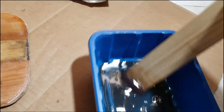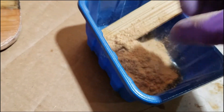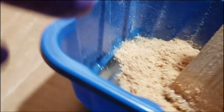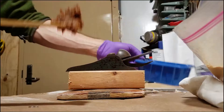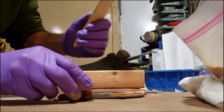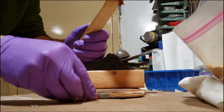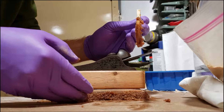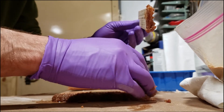I've mixed up another bit of resin, and now what I'm going to do is take this very fine wood dust — like sanding powder from sanding — and just throw that all in here. You want to add it a little bit at a time; you kind of want it at a toothpaste consistency. Here's about half of it. Don't worry about the cardboard sticking since that will be sanded off later. Just kind of squish it onto there and push it in — make sure it's tight in there.